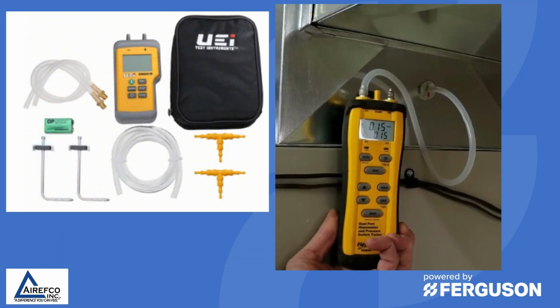So it is my professional opinion that every technician working in HVAC should have some type of manometer. The most common type today is the digital manometer, and you should have one with the proper tubing, the T's, and the pitot tubes to take readings in a ductwork. If you've checked the entire system and made sure that all the registers are open and free, and that there is proper design of ductwork, the only way to determine whether you have complete airflow across a coil is by taking a traverse reading with a digital manometer. So next time you're scratching your head on a job and can't figure out why an evaporator coil is freezing, get out your manometer, punch a few holes in the ductwork, and find out where your turbulence is, and then fix it.